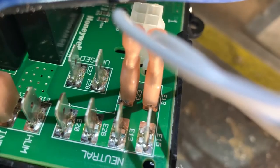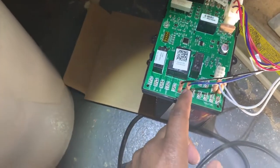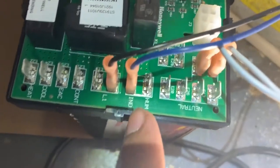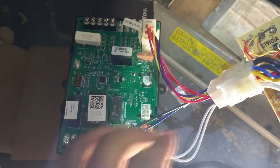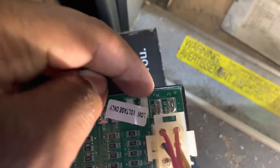E18 and E23 for our two white wires. Blue goes to your IND — that's from the universal cable, blue to IND. Your black wire from your universal cable goes to your L1. X and C — we're going to go to X and C.